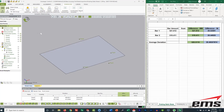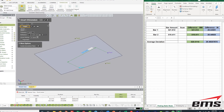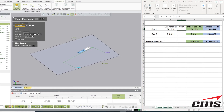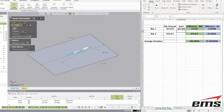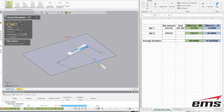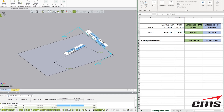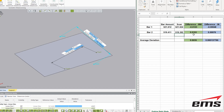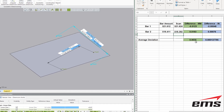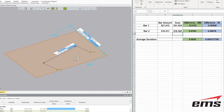We're back in the inspection software — this one is pretty straightforward. We measure from one point to the next and key in those numbers. The first measurement gives us 521.6243, a difference of about 12 microns. The second measurement from this point to this point gives us 519.3917, a difference of about 19 microns or seven-tenths of one thousandths of an inch. Very good numbers on these two ball bars doing probing in static mode.